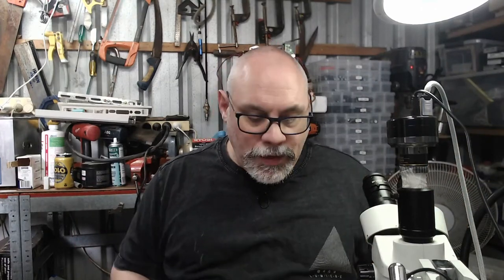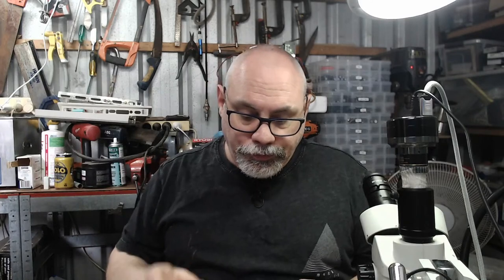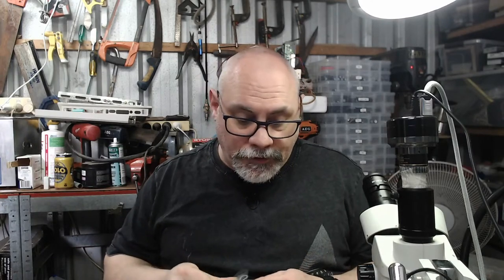But here is the thing. This is the thing I want to see if I can illustrate in this. So when I spoke to the customer about this, they said, oh, look, it's having a problem. I think it was either not starting up or a problem with the sound or something like that. One of the problems associated with these. So just as a quick reminder, with these things, when they have leaky capacitors on them, one of the first signs is usually that the sound goes on them. So it's a very common thing for that to happen.